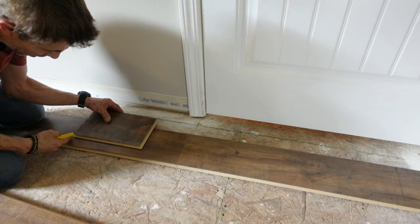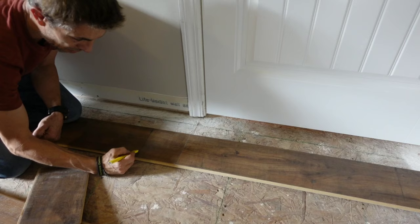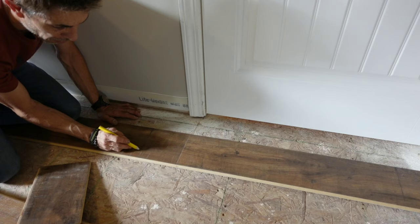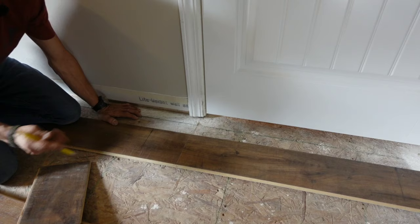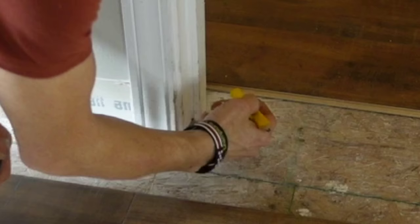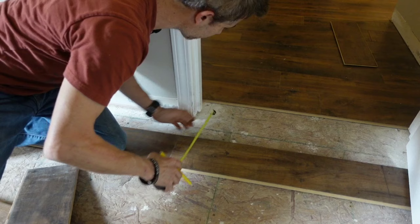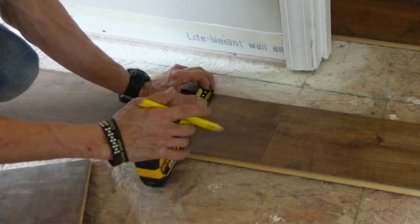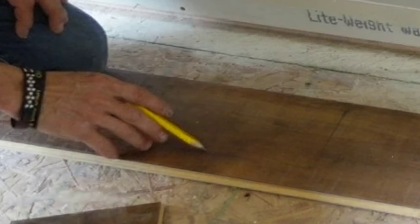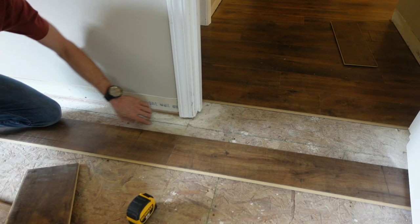Right here, the line we made is going to run all the way down, so I'm going to extend that out. The line is coming here and going here. If the baseboard had been on, I'd come over about a half inch and make it at an angle. I'm going to use my tape measure to see where it comes out and make it as close to the wall as possible — about a quarter inch inside the laminate face, which comes out to four and three quarters. If you had the baseboard on, you'd want to come out at a slight angle, another three-eighths of an inch, so you still have a little expansion between your base and your floor.